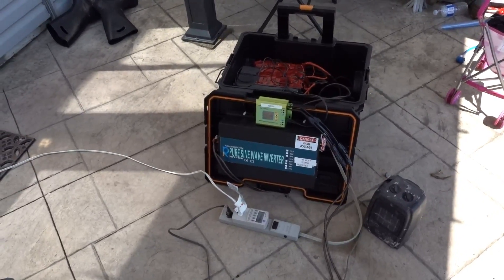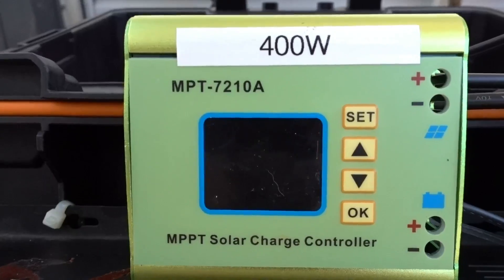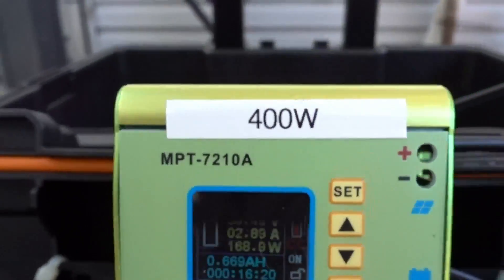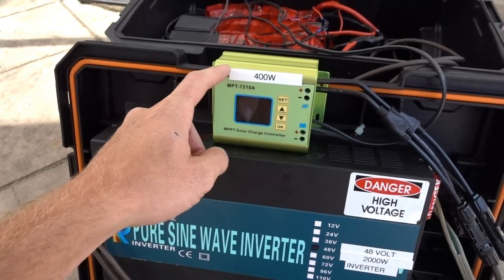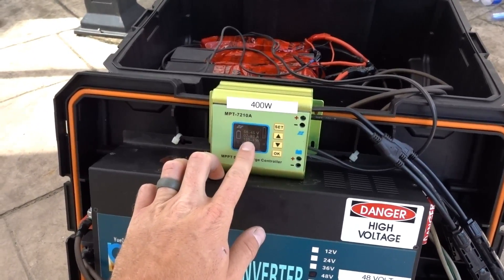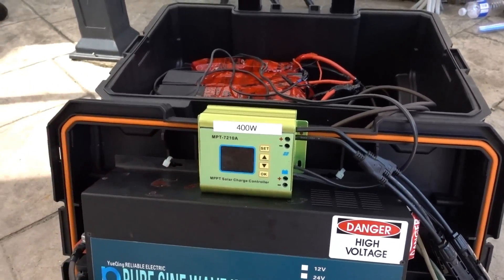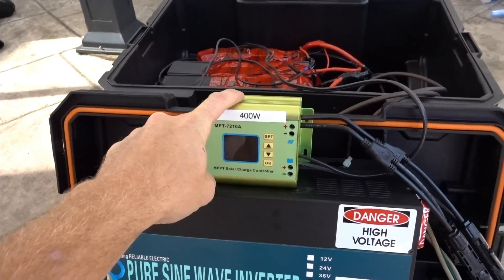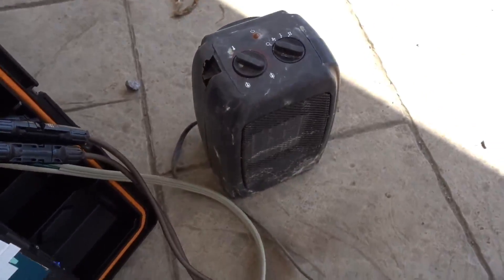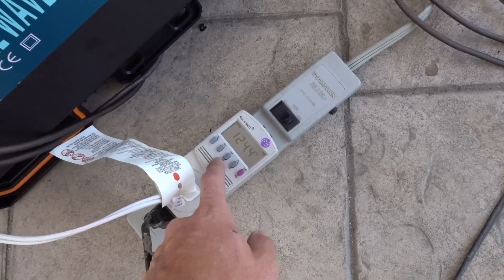So today I got this set up in the shade here, hooked up to two solar panels. My issue is this one doesn't seem to be putting out more than about 170 watts, where before I've had these things put out quite a bit more. I'm thinking it's because my solar panel voltage is half of my battery voltage, so it's putting out a lot less power. You would still think it would do the same watts though — I don't know, maybe not. I have that same window air conditioner plugged in and running, and we are pulling 811 watts holding at 124 volts.